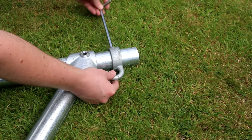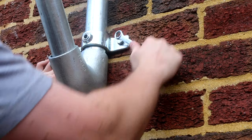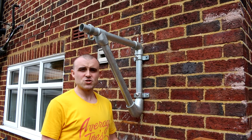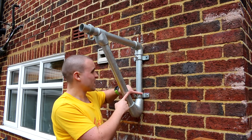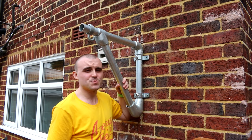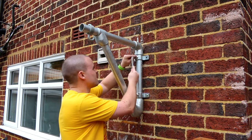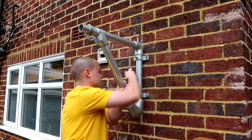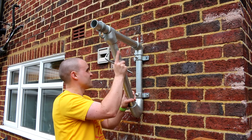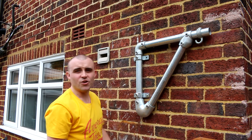To hang the punch bag on the frame we just need to add a hook. To mount the frame to the wall I used 50mm long M8 coach screws and 8mm wall plugs. For the time being I've only got two anchor points — one here and one on the top of the corner. A huge benefit of using these fittings is I can loosen them and then with them loosened it can fold against the wall — nice easy storage.